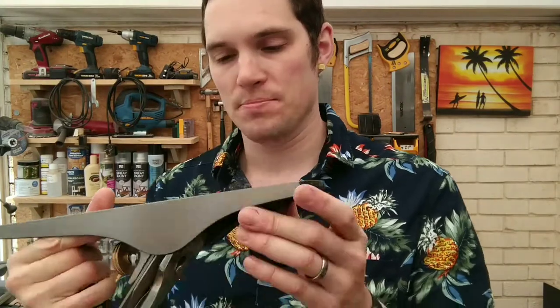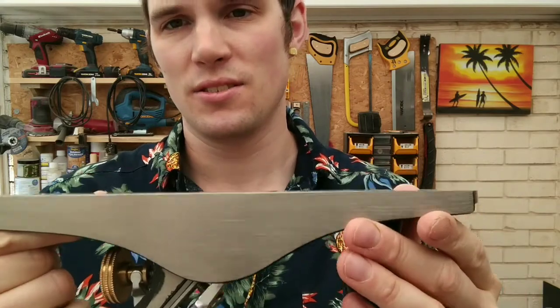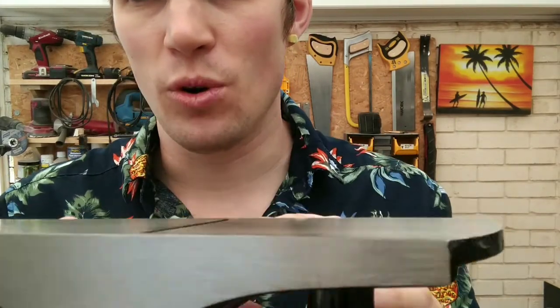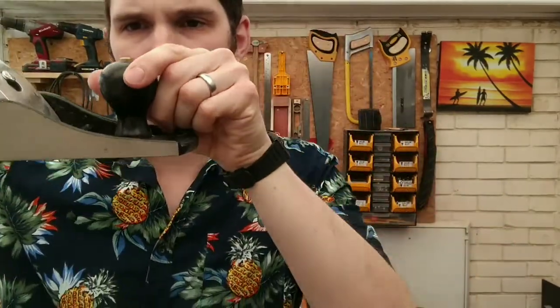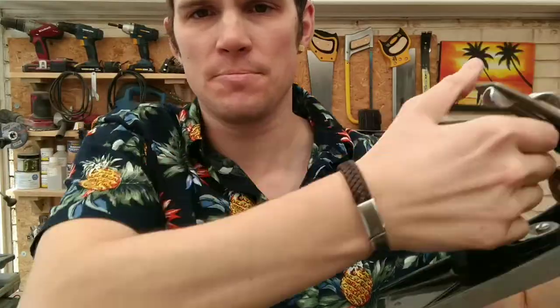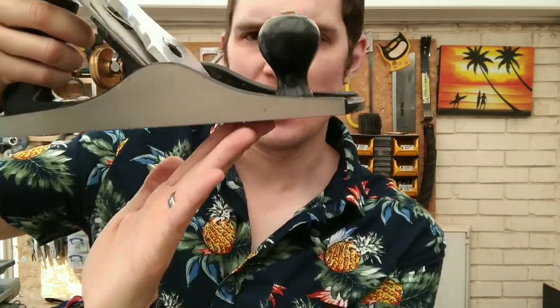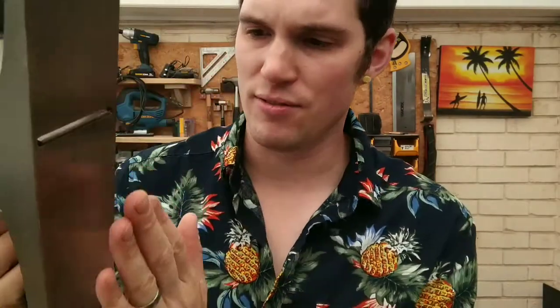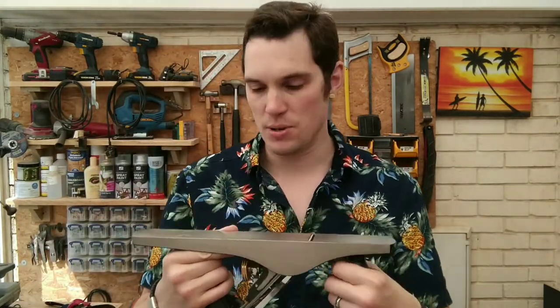This is the one that I use for smoothing out long large pieces of wood, so they start off really rough and turn into something smooth. Starting off with a larger plane, you can see it's a very nice smooth flat surface along the bottom with a small blade sticking out. The blade is set down at an angle pointing forwards and as you run the plane along the wood, the flat surface rides along the wood and that blade cuts or shaves the top off, leaving the wood hopefully matching the flat surface. Because it is long and flat, you can go the length of a piece of wood and get it smooth.